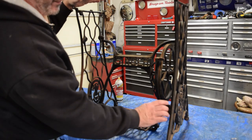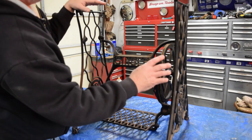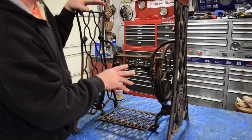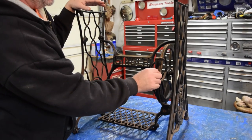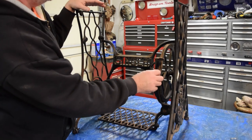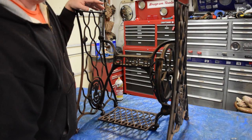So what I'm going to do is just start taking this apart piece by piece. If you are doing this and it's your first time, take lots of pictures, take notes, pay attention so you remember where things go back together. It may look very, very complicated, but it's not that hard to take it apart.